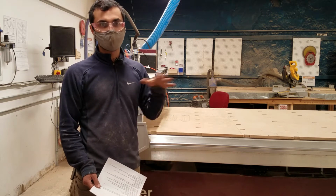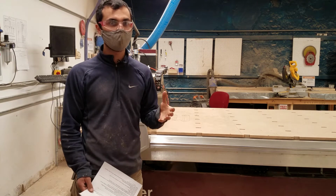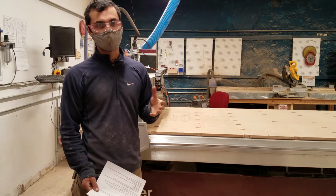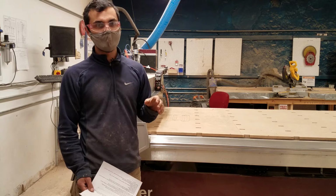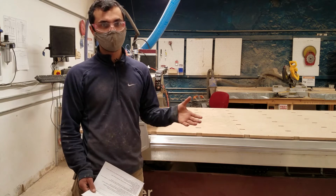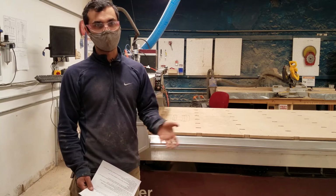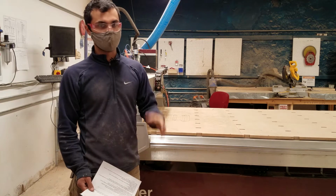In terms of doing full 3D stuff, I would recommend using Fusion or SolidWorks or some similar program. There will be other videos covering that, which you are more than welcome to watch. If you are doing more complicated designs, then you want to be designing in VCarve, you can use Illustrator, Inkscape, any other number of software that you can then import into something like VCarve and turn it into G-code using that software.